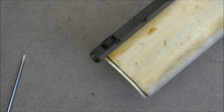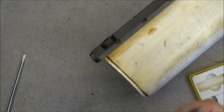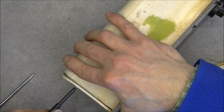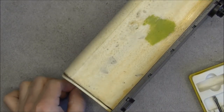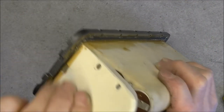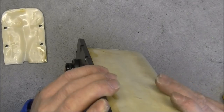So let me grab, maybe with this old mobile phone opening tool kit, I will be able, because there is this kind of tool in this. If I do this one, as you can see, the thread is coming too far and I cannot use a regular screwdriver. Yes, it is good. Okay, but it is not really tight, by the way. So now I should be able to undo the... Yes. And it looks very much like nickel-cadmium cells. Here they are, as you can see. Some insulator piece, and probably nickel-cadmium cells all the way along.